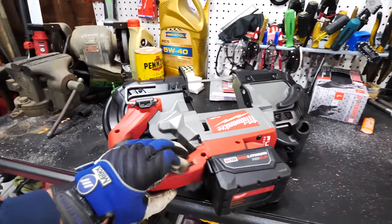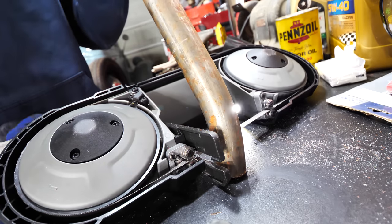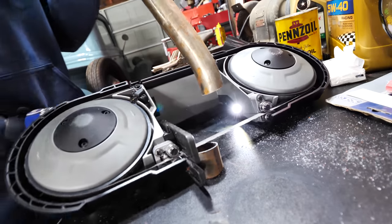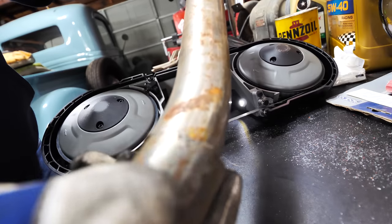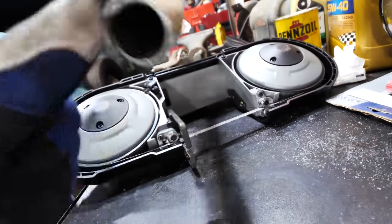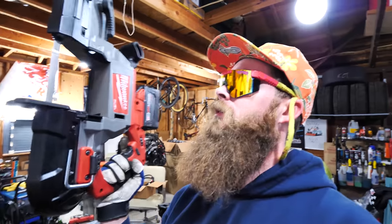Let's cut something a little more heavy-duty — that was just thin sheet metal. Going up to speed five now. Oh, making life so simple. Super clean cuts — if you need something you're going to weld right away, like pie cuts or anything like that, you're practically ready to go. Just clean it up real quick and start welding. As far as one-handed operation goes, you can do it, but this thing is really heavy.